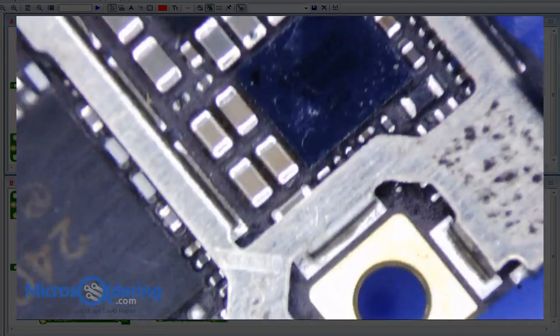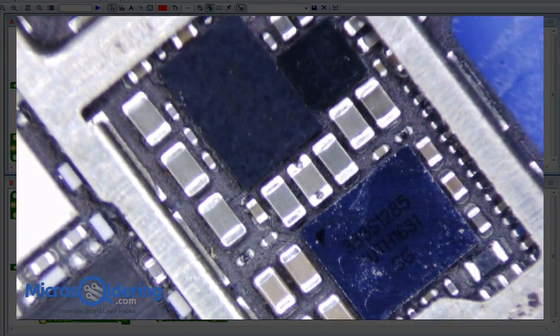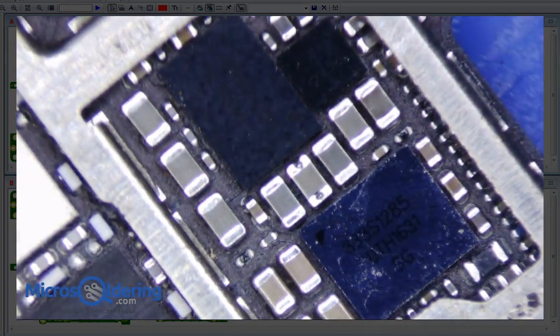The NAND looks clean. This looks clean. This is Tigris. So let's check for a short on VCC main. That's the first thing. And we'll just kind of probe around Tigris a little bit. Tigris is the incoming power supply, and it actually provides the charging for the iPhone.